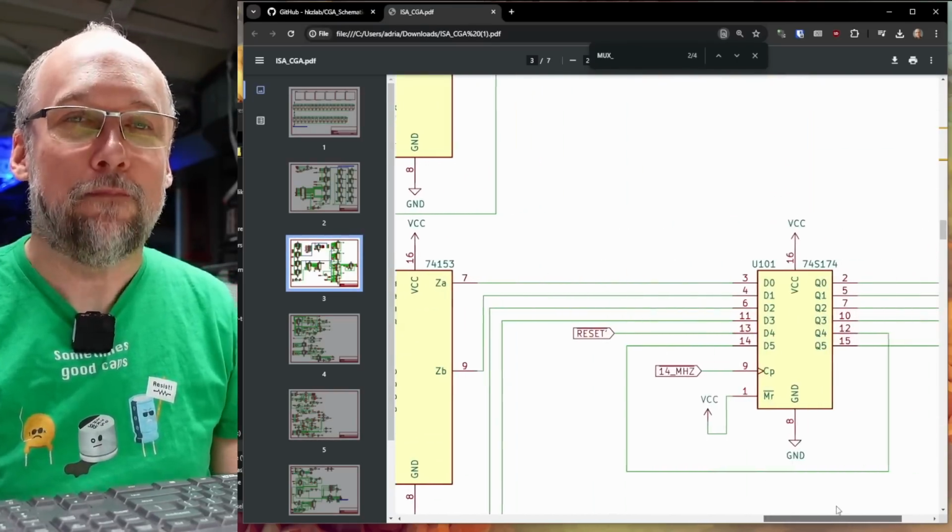generates the video output. So the problem that we're having absolutely has to exist in that chain that we just looked at. And we can ignore all that stuff at the end, and that's because we know that stuff is working because the color is working, the graphics are working, that all goes through those chips near the end.